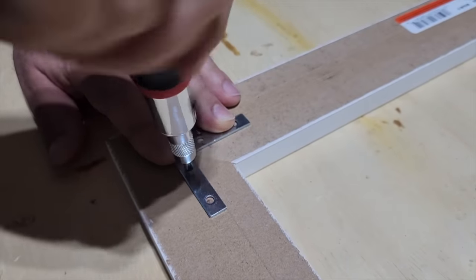Once you get all four sides, we've got to build a box so we can cover the sides of the TV. I use a little bit of 1x4 and, again, you've got to use that glue — it holds the sides together. We're going to use 45-degree cuts and look how smooth that is. You can use screws or nails, but I go ahead and use a brad nailer. It's real easy to use and puts a nice fine fastener right inside. I just used three on each side and it gives it a nice smooth look.